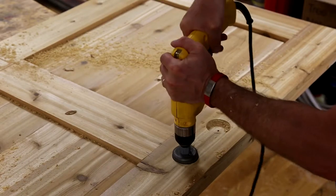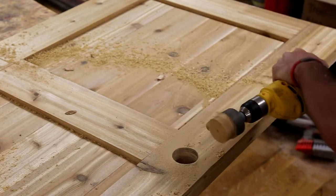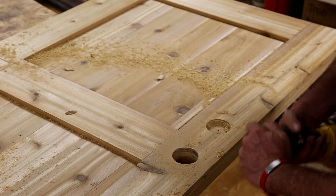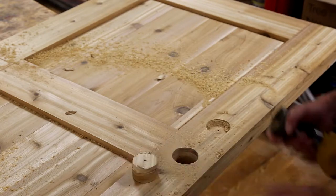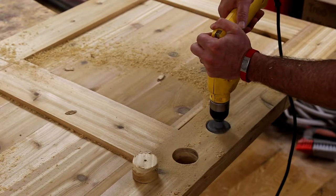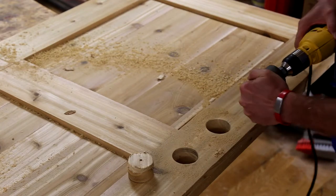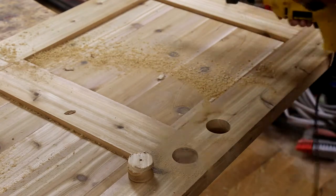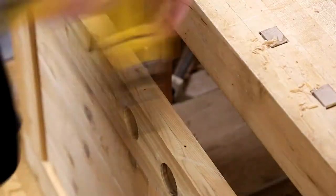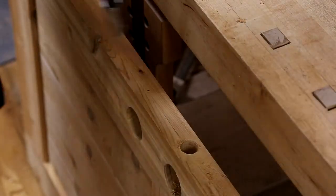In a process that should have been finished with far fewer steps, I finish off each of the two through holes. The perpendicular holes are cut with a one-inch hole saw — I happen to have one with carbide teeth that makes a nice clean cut.